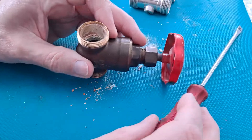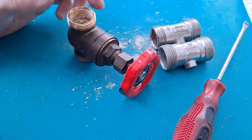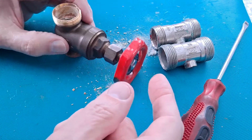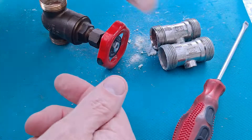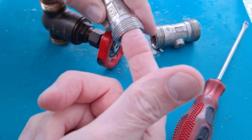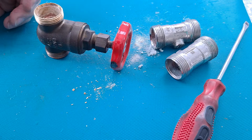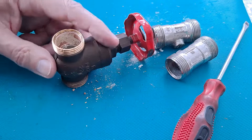What I had to do to do the work was actually drain the tanks down — the cold water tank in the loft. Let everything out of it. I could have put a rubber bung in it — where the pipes come out of the cold water tank, I could have reached inside and shoved a rubber bung in to seal it. But I didn't. I drained it right down. If it's drained down, there's no way it's accidentally going to leak when we're in the middle of working on it.